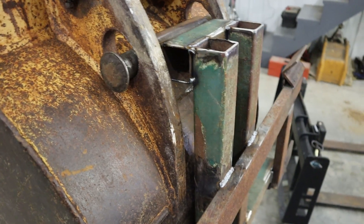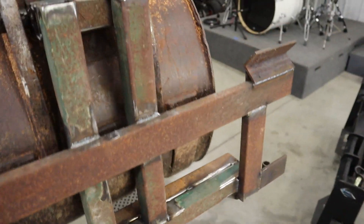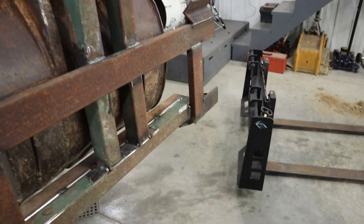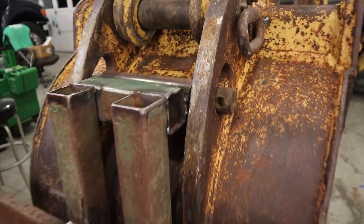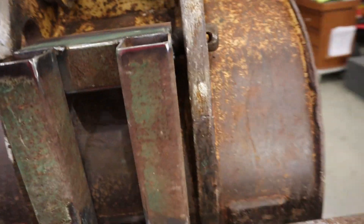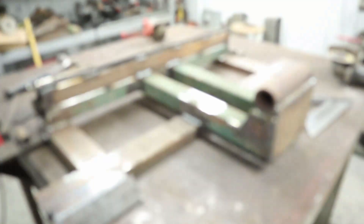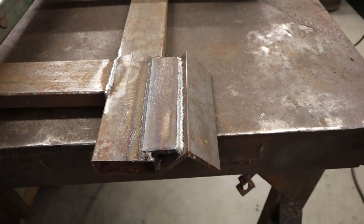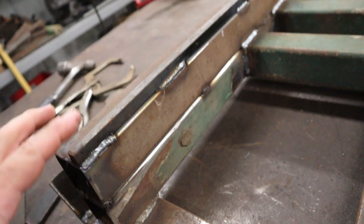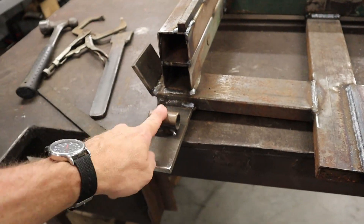I think that's gonna work great. It's a one-pin operation, and both of my backhoe buckets have the same hole in the back, so hopefully no matter which bucket is on the machine, if I need to use this I can pin it on. It basically floats on there, so if you get the forks in a bind or they're up high and hit something, it's got some give and movement — hopefully I'll be less likely to bend it all up. I'm going to reinforce this by putting a plate across the top to make it stronger, and a couple of gussets on the inside to support that. Since all the weight is hanging from this, I want to get it reinforced, get it up on the table, and weld it all up. I put this extra half-inch bar on here because I was a little short of touching the back of the bucket, and I made another pin last night for the latches right here.